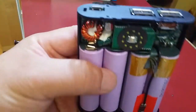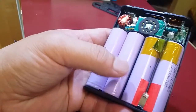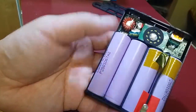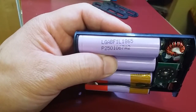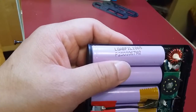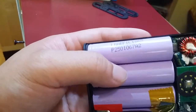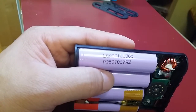There are fake LG cells out there, so you do have to be careful. How do you know if these are real? It's very hard to tell. Sometimes counterfeiters use cells that aren't LG, but sometimes they take older LG cells that still work — so you can't easily tell real from fake. It can be very difficult to determine if they're legitimate unless you desolder and test them yourself.